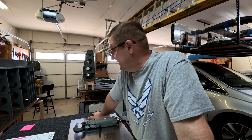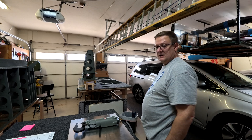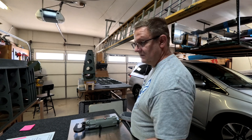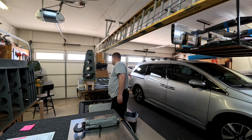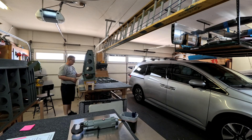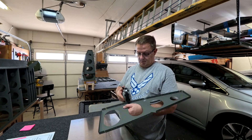I'm dimpling them at the same time because I didn't go through and dimple the bottom pieces yet - that's step three on page 1402 - so I'm doing both kind of at the same time. I also primed all the flat brackets so they're ready to get attached, which is a page or two further in the instructions. Make sure you read the entire section of instructions because there are things further on that you'll need to know earlier in the process.